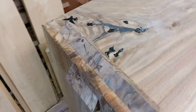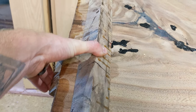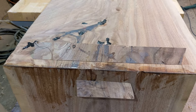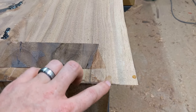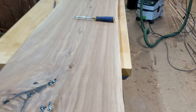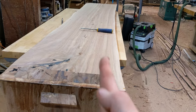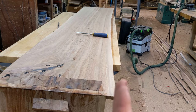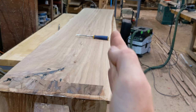I didn't record while I was gluing up the waterfall edges because I just stress so much about the glue-up. I CA-glued two 45-degree angle blocks onto the lumber itself and then used those to clamp everything down. You'll see this overhang on the top part of the slab — I'll contour that, cut it with my jigsaw, and then shape it with my sander so that it all flows as one solid piece, and then I'll do the same on the opposing edge as well.